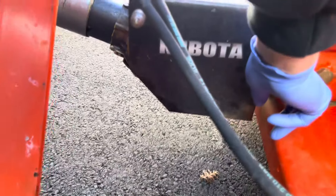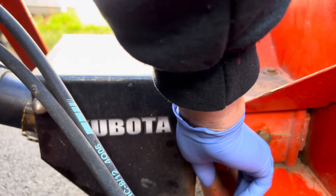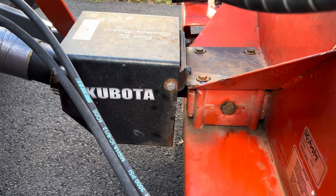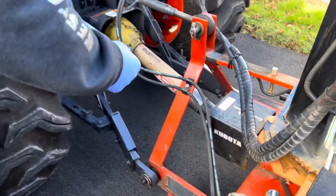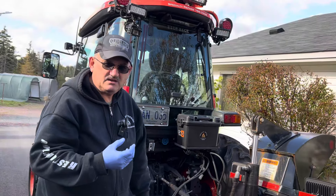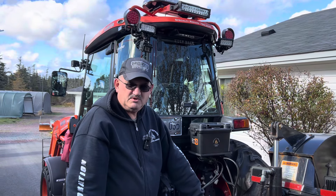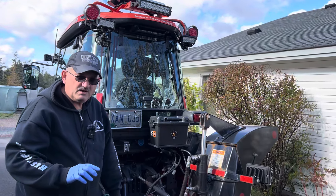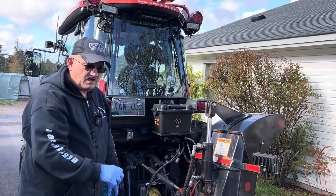This here is a plug. Remove that plug and you should see the oil right on the very top of the bottom thread. If you don't, top it up. If you haven't changed your oil in a while, do so. You'll have to suck it out with a vacuum pump or something, because there's no drain on it. Mine takes 80w90, so that's what I usually use. While you're there, make sure there's no oil around it — if there is, suspect the seal and replace the seal on that gearbox.